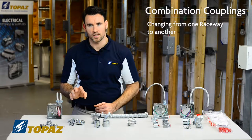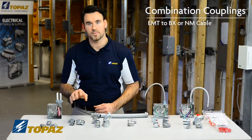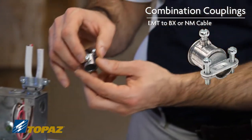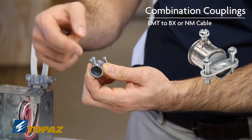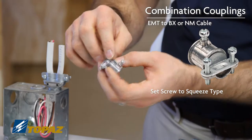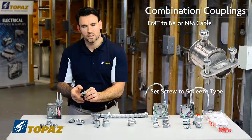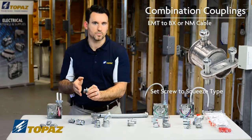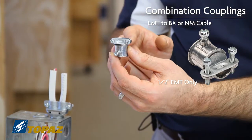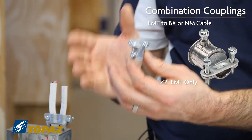For example, if you were using electrical metallic tubing and you had to convert over to non-metallic sheath cable, NM cable, you would use a connector like this. This connector is a coupling which lines up on the EMT with the set screw, and then it has a squeeze type connector here for the Romex. This allows you to convert from Romex into electrical metallic tubing. This particular fitting only goes up to half inch diameter for the raceway electrical metallic tubing.